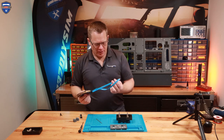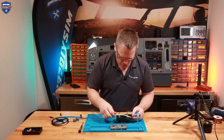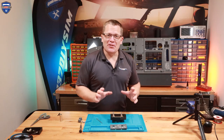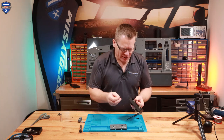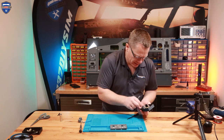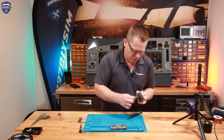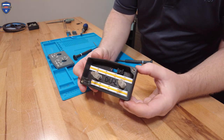Now we need our backlighting tape. This is 12-volt LED strip, and we're going to put two strips — definitely one across the top, and one across the bottom for extra lighting. There's our LED strip fitted. We've got to wire it up. We could do with cable restraint by putting a tie wrap mount in there, so to make it look tidier I'm going to put the screw in from the back so you only see the dome head rather than the nut and protruding screw thread, hiding the mess on the inside. There's our tie wrap mount in the corner.